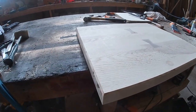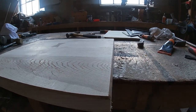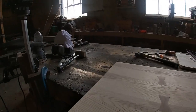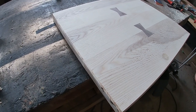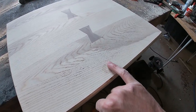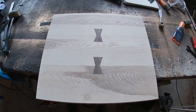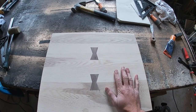We've nipped the ends off of this board, made it relatively square, and then I took my router and added a bit of a chamfer to all of the edges — just to give it a little bit of lightness and make it look a bit more finished. As you can see, we've got some burn marks from the router and some marks from my clamps. So it's time to start sanding. We're going to go up through the grits — start at 150, go to 220, and then it's time for finish.